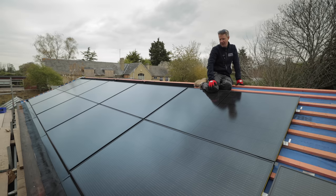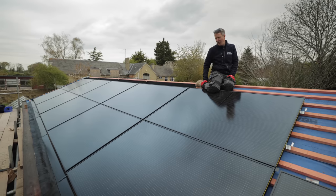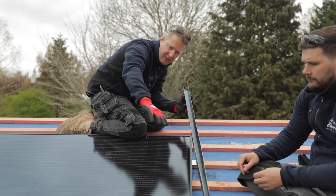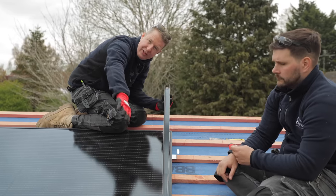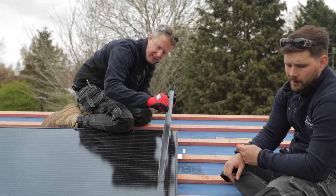This last bit shows the flashings and gutters in between - it's a very clever system how it all fits together and enables a completely sealed roof space, so rain can pour on it and debris can come down and it'll all just wash off. This is the first part of the guttering system that goes in between the panels vertically - it catches the rain and allows it to run down to the bottom without anything leaking into the roof.